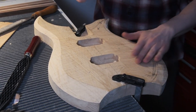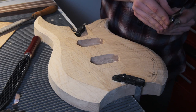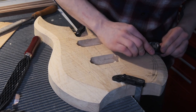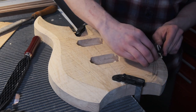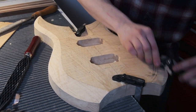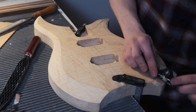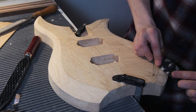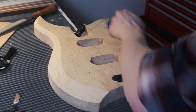With spoke shaves, a very good thing to do if you have cross grain or if your spoke shave isn't as sharp as it should be — first of all, sharpen your tools. But if it's not sharp, then holding it a little bit at an angle is a bit easier to manage than trying to take away directly toward cross grain, because that's just going to make you sad. Now going back to the Shinto and using the finer side.